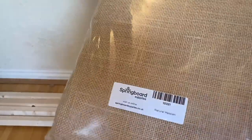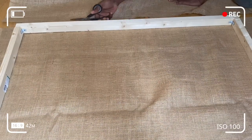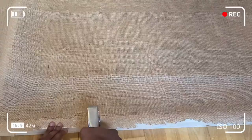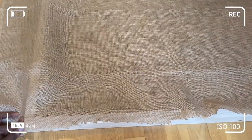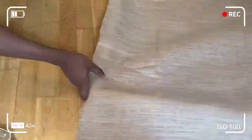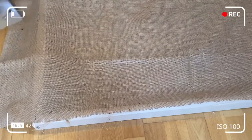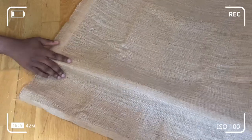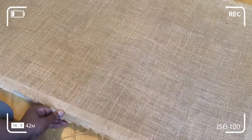After piloting, screw down all brackets. The next step is to cut the backing fabric around the perimeter of the fabricated frame. Stretch out the backing fabric and using a staple gun begin stapling from the center outwardly on all four sides of the frame. Make sure the backing fabric isn't sagging. Right before you begin stapling, you can apply Gorilla Glue around the perimeter of the pine wood to provide reinforcement.